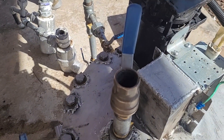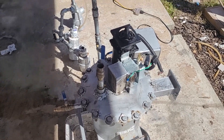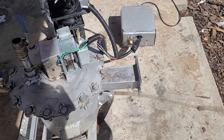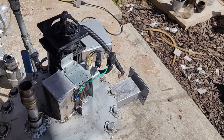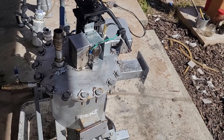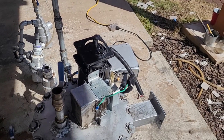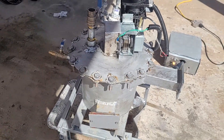I know exactly why — it's not the magnetron on top, nor is it the agitator. It's actually a matter of geometry. I have two ports on this reactor that are no longer being used because they were for the experimental mounting of the magnetron on top. The issue is they're completely empty dead zones — gas would go in there, and microwaves will too. So instead of microwaves bouncing around the reactor walls and reaching the plastic from many different angles, a good bit of the microwaves are being trapped, especially in this second waveguide here.